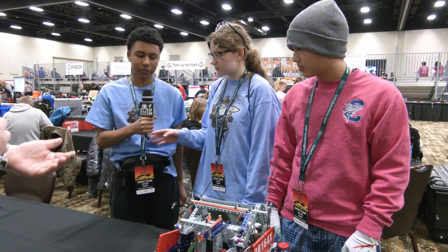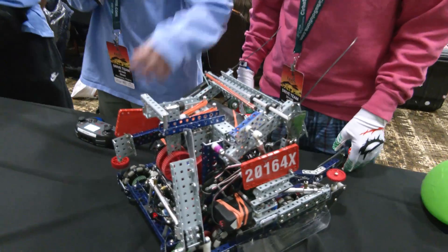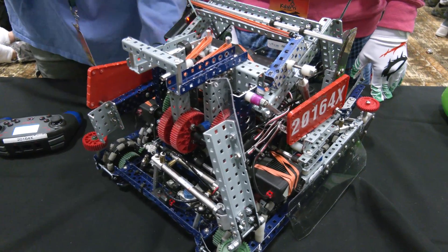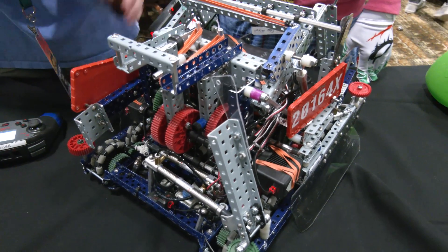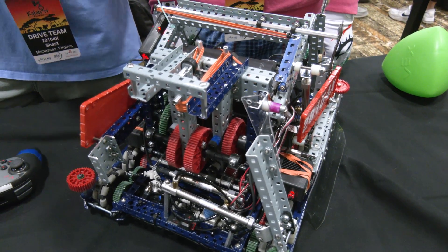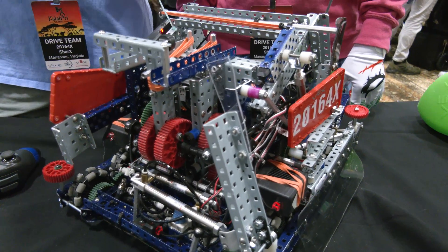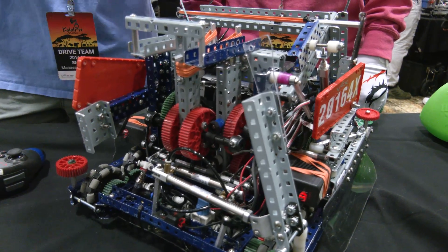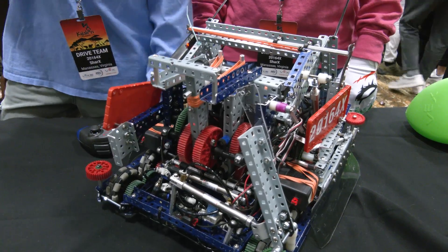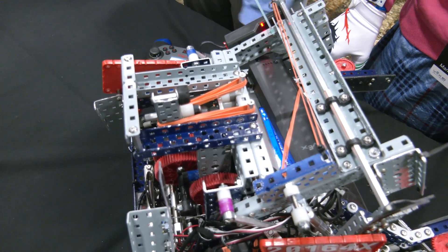Jenna, let's talk about the catapult. So our catapult is run by these two 200 RPM motors, again with the PTO. Right now it's in the eight motor drive mode, and when we activate the PTO into catapult mode, we have a geared torque increase by about eight and a half and a speed reduction by about one and a half because the catapult doesn't make a full turn — it's about 0.15 of a full rotation because of the amount of teeth we have cut off of our 12 tooth gear. So it runs at about two shots a second, which is fairly fast, and our match loaders sometimes can't keep up with it. But we're still learning as it is a pretty new design.